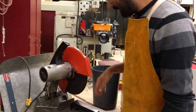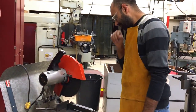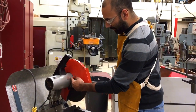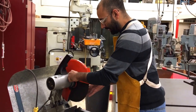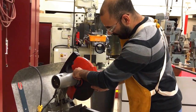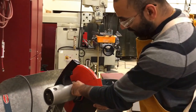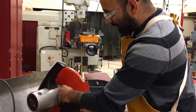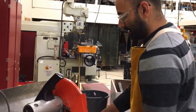Take a good look and if it looks safe — no cracks or big chunks missing — you can also check whether the blade is properly secured. There's a blade lock on here: spin the blade while pushing the lock until it engages. Once locked, grab the blade and give it a wiggle — it should not slip or slide anywhere. If the blade was not tightened on properly it could actually spin loose, so this is a quick check to confirm the blade has been tightened and won't come undone.